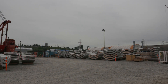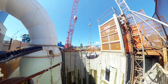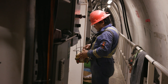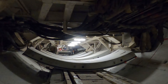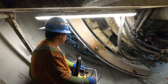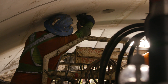Today we're building ring 608 out of a total of 719. Each precast segmental ring is comprised of six precast concrete segments. The ring segments are carried down the tunnel on the mine train. Then a vacuum lift picks up the pieces and sets them down onto a track that moves them underneath the erector equipment. The erector equipment then lifts each ring segment into place. These segments weigh up to 3,600 kilograms — that's 8,000 pounds.